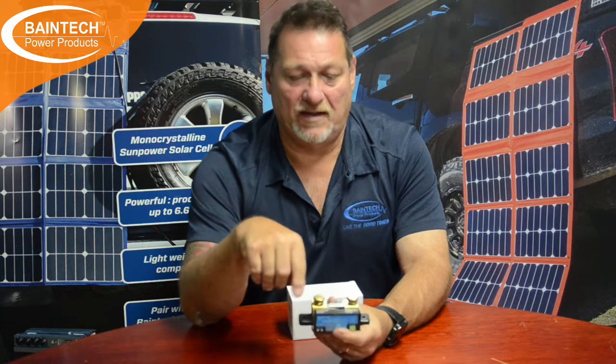When I looked at it, I asked what the battery voltage was and he said it's sitting at 13.6. I said, mate, your battery's fully charged — it's a lithium battery — but it's only showing 70 percent. When we actually went through and deciphered it, I said start up your car, we started it up and instantly we could see that there were no amps being registered going in through the shunt on the Bluetooth on the phone.